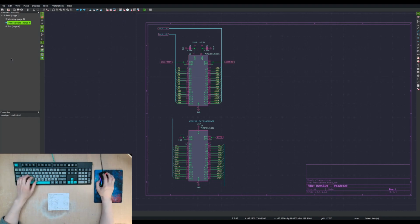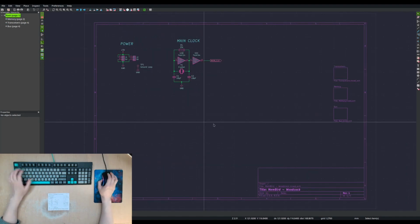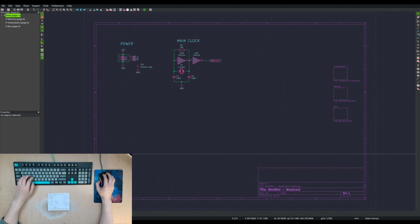So that's something we should try and achieve if we can. That's the one stretch goal of this board. We're not going for the A40 cycle. We're not trying to do any 32-bit. We're just a simple 16-bit 3U card. But if we can do 3.3 volt memory as well as 5-volt memory, then we'll be good. Then we have options. We can use a lot of different RAM chips, which would be nice.